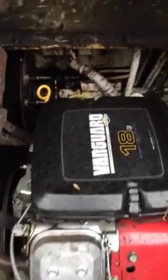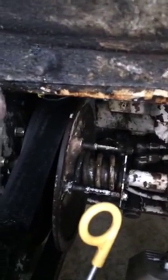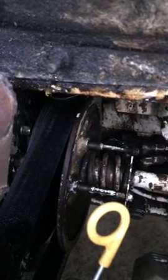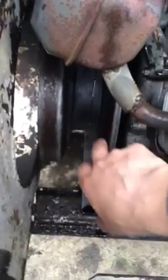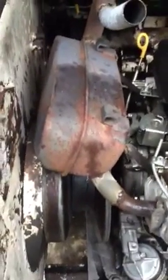When I mention split jack shaft, see my secondary sheaves — that whole secondary sheave assembly is spring-loaded, so that will separate. If you use a big fat tie-down from Harbor Freight — they're probably like 10 to 15 bucks — you can wrap it around the belt, run it underneath the frame of the Bobcat, and crank your ratchet tie-down to pull that belt back. You want the rear loop of that belt directly over the shaft of the engine. Then take the two halves of the sheave, put them together, bolt them together, get them tight, and release the ratchet. The whole thing will fall into place.